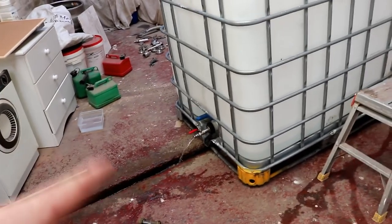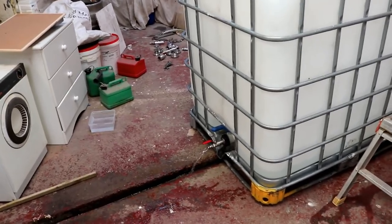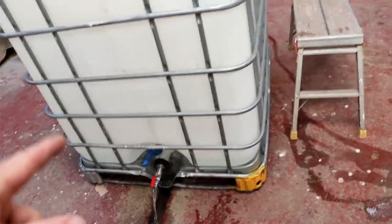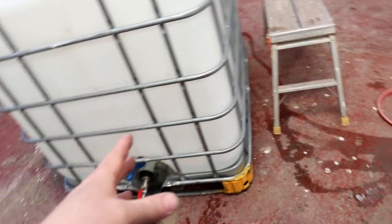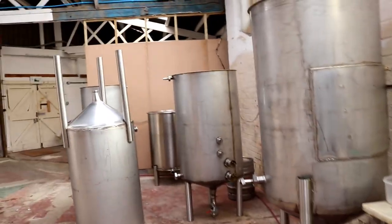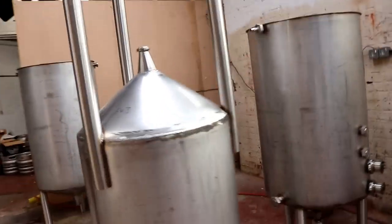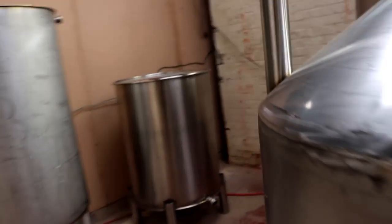She's had a rinse out. I decided to hold back with the caustic because I didn't want to waste it. If I fill this up with caustic I can then transfer it and clean all six tanks in one hit with the same caustic solution - it makes economical sense because caustic is expensive.